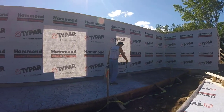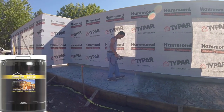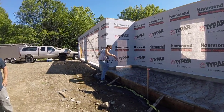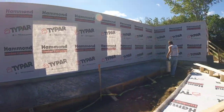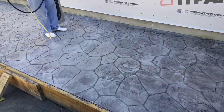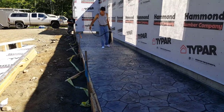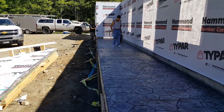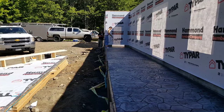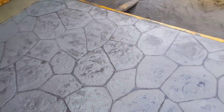The day after we wash it, we come back and put the sealer on. My go-to sealer is the Foundation Armor AR350 and we're going to put a couple coats on. The concrete's all dried out, so we spray on a really nice light first coat — that stuff dries in about 20 to 30 minutes. You can see how the sealer brings out the color in the concrete. We put on the second coat nice and even, spraying at about 300 to 400 square feet per gallon each coat. We don't want to get it on too thick. And that's how we do our stamped concrete — that's the final look. Thanks for watching — see you in the next video.